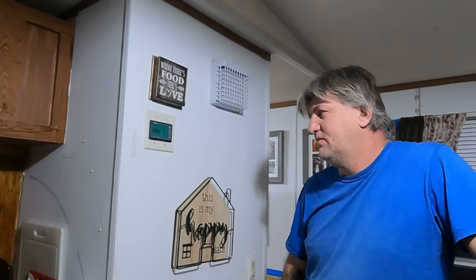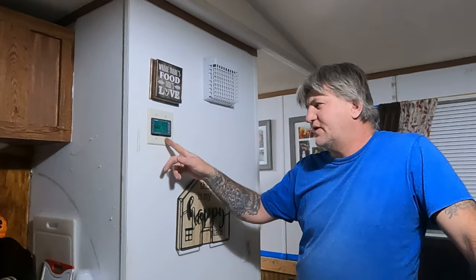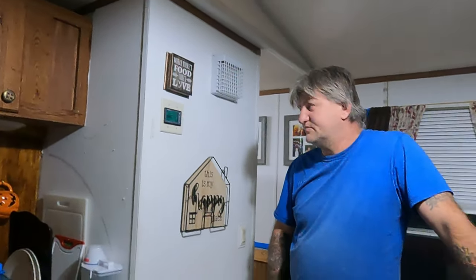If we get that other generator working, then I'll have to rewire the plugs, of course, but then I get 40, 50 amps at least going into them, because I may leave it at 120. I think I'll put out like 40, 50 amps at 120. But if we get the other one working, I'll just put it back on 240 and throw the whole 100 amps on it, and I'll charge them quick then.